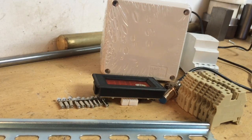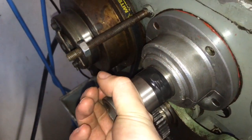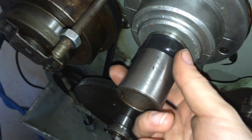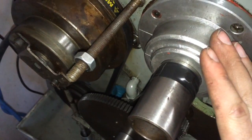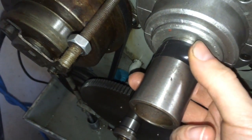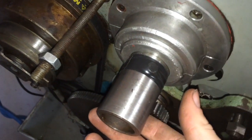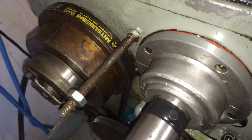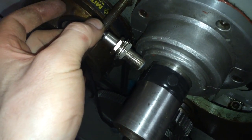I'm here at the back of my lathe — this is the back of the spindle. I've just taped a neodymium magnet to the spindle. The reason I used tape is because I didn't want to epoxy, weld, or drill anything into the spindle, especially because this bearing cover has to come off if I need to service the bearings. With tape I can just peel it off, and it's more than enough to hold the magnet. The magnet is even strong enough on its own to hold itself to the spindle at full speed. This stud holds the cover, and I'm going to put a bracket here which will hold the proximity switch around one or two millimeters away from that magnet.